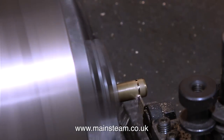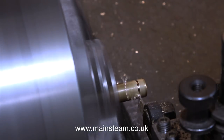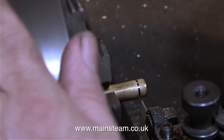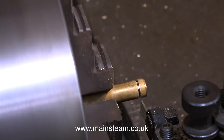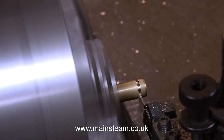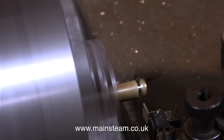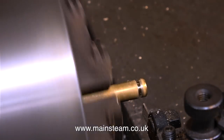With the ram fitted into the four-jaw self-centering chuck on my Smart and Brown lathe, using a very small parting tool I started to turn a groove in the end of it. Once I turned the groove I widened it because I didn't want the O-ring to be a tight fit in the groove. There's a wealth of information available online about the depth of grooves in pieces of metal bar to take O-rings, but I just did it by eye. In this clip I'm just using a piece of emery cloth to remove the sharp edges.